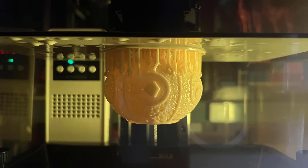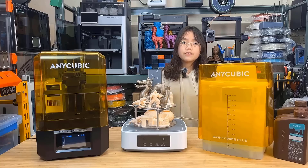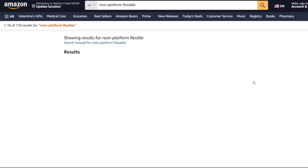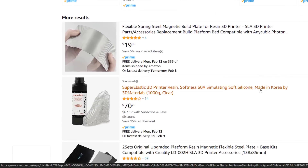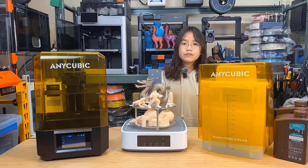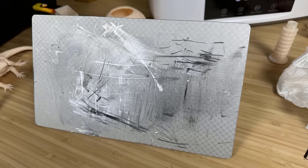Three: the build platform sticks a little too well, which makes removing the print a little tough. This is a common issue for resin printer platforms — if it doesn't stick well enough, the film on the resin tray will pull it away and cause the print to fail. I would suggest using a surface that sticks well but is attached with countersunk screws instead of magnets, so you can remove a few screws and flex the plate to release the models. The plastic scraper that came with the machine is not strong enough for large prints, and using a metal one will scratch the platform.